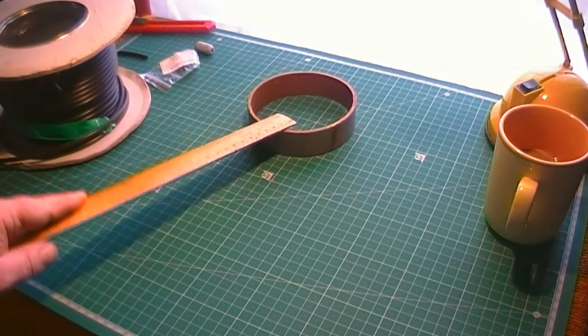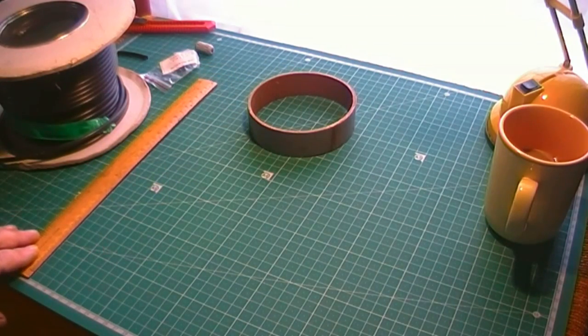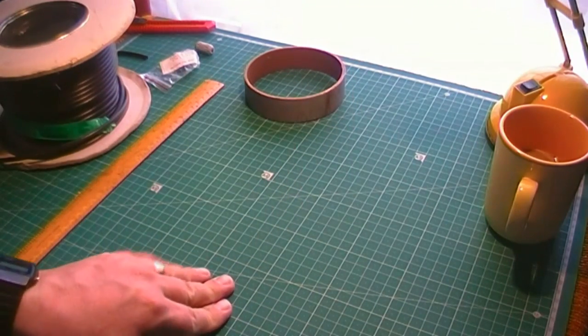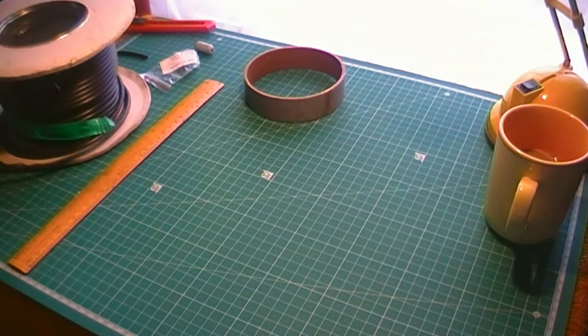And with that choke being absolutely critical to this antenna, there we are. Might take some experimentation, or if you've got the kit to measure all this sort of stuff, it would be time to get it out if you're looking to make something out of RG8 Mini. In addition, RG8 Mini, I don't really use it much in my sort of